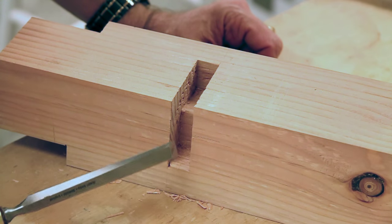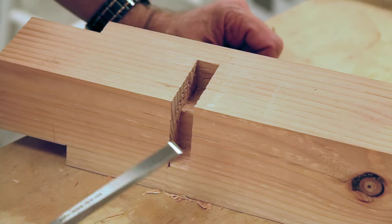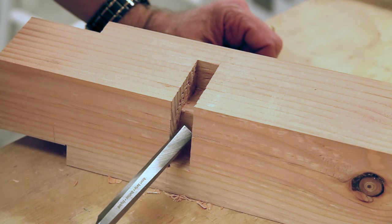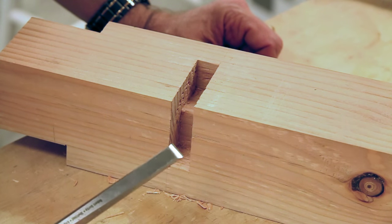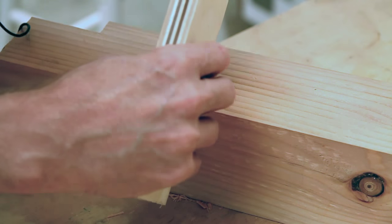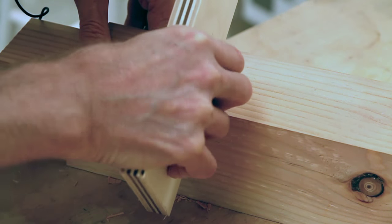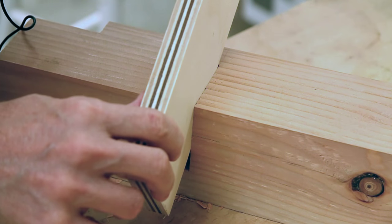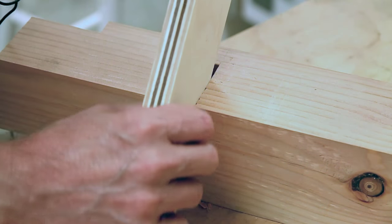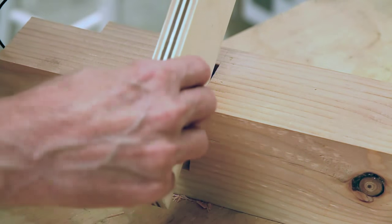All right, well, I finished two mortises, one on each side. And of course, they join since I've done this in the corner, just using the chisel. And at the end, I used a router plane to finish the bottoms. And it fits nice and tight. I thought originally I was going to need some fasteners, but I think how this is fitting, just glue is going to be all I'm going to need. It's not gappy at all. I'm really, really happy. All right, just need to do this two more times for a total of three shelves.